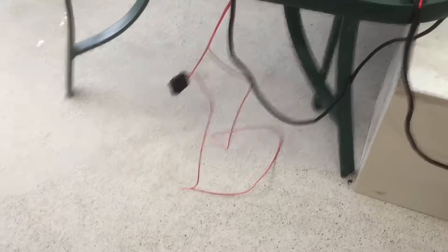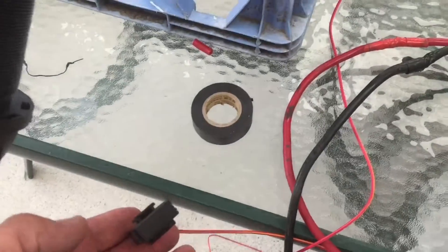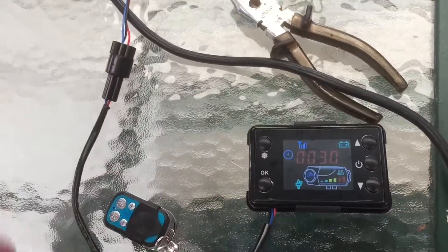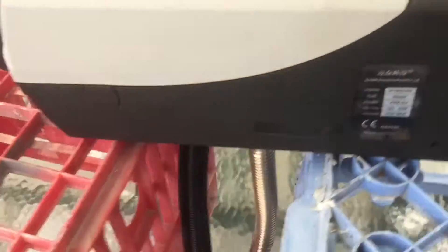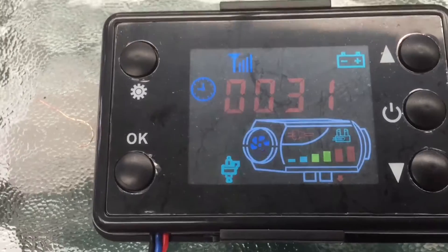When you connect these in, make sure this is on its own circuit. Don't connect it to say your reading lights in the caravan or some other power, because it's pretty important that these go through a shutdown process when you actually shut them off. When you hit the off button they go through a shutdown process - it's like a computer when you shut it down. I'll shut this off now - push and hold the power button. It's off. Now it's actually shutting down, going through some process to shut off, like a computer.